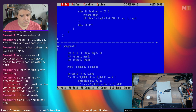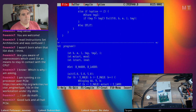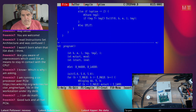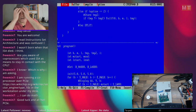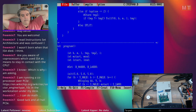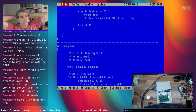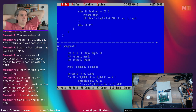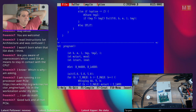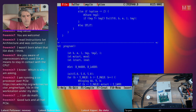I would like to create my own version of the interface card that doesn't need bodges. It would be nice to have the faceplate all lined up properly. But I'm pondering recreating it as, apart from the 25-pin connector and the headers, the jumpers, purely surface mount rather than through hole. I know it sort of goes against the idea of old school computing and through hole components, but if you're making it new, it makes more sense to use newer components.